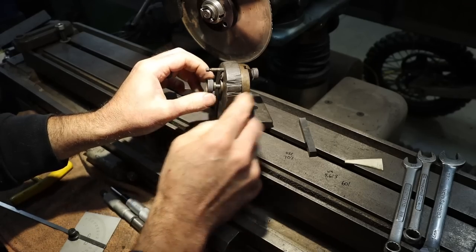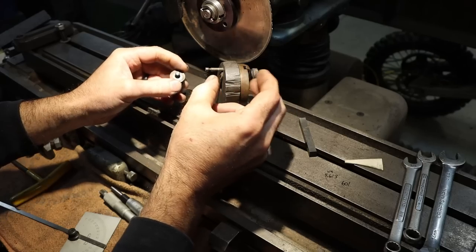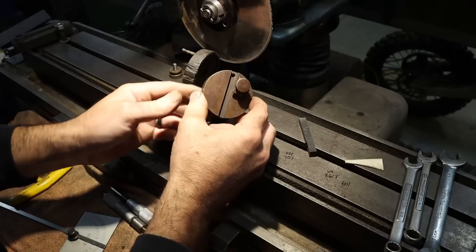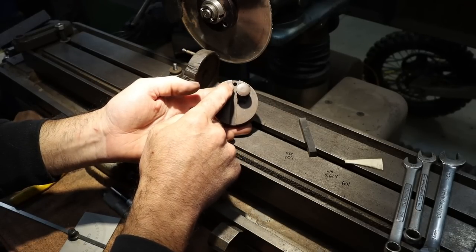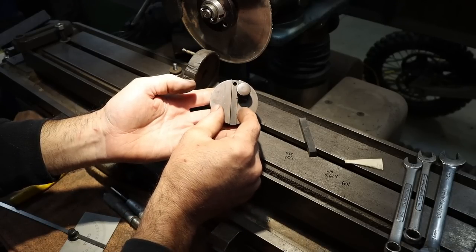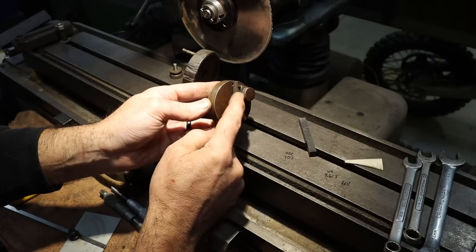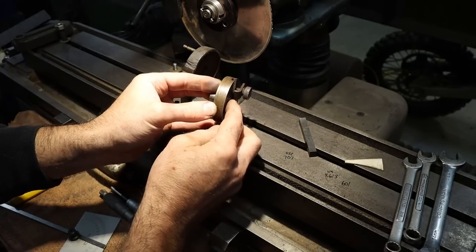So we just got a thumb screw in the back to lock this thing down, or just to hold, I guess, tension on it, keep it all tight together. And it's nothing more than a piece of round stock that's had a slot cut in it. Now, if I was building one of these, I would try to find a way where I could make it hold, maybe do a stepped slot, one for half inch, one for 3/8, and then one for 5/16 maybe, or quarter, whatever. That would kind of be what I would think, and maybe a little larger screw, you know, to hold that. That way you could grind a variety of bits with this.